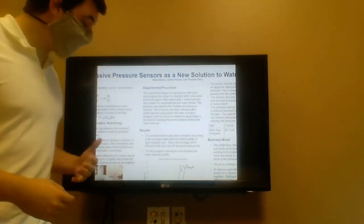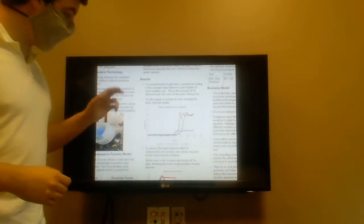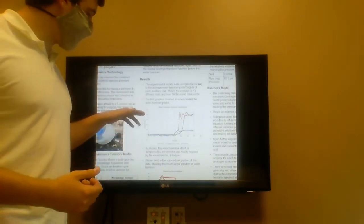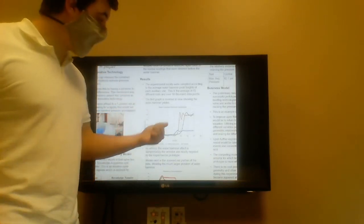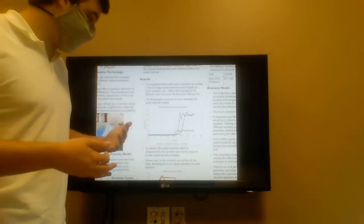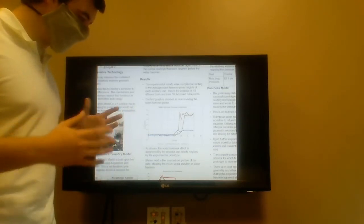As you can see in our first graph, just showing the water hammer spike, the red and green being control and water hammer arrester respectively, they spike up to about 40 psi. The control has more spiking and therefore more damage, but the water hammer arrester going up to the same pressure had less spiking.